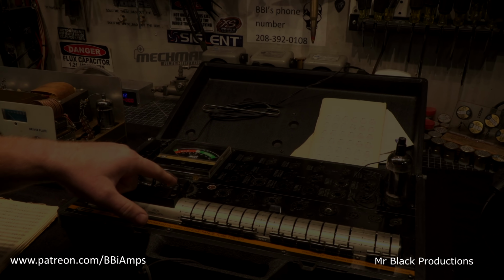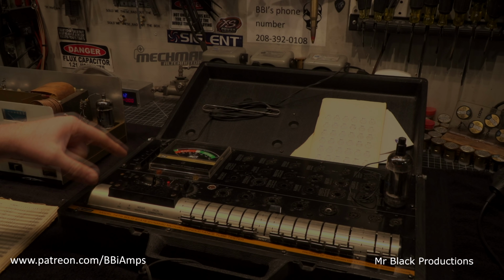It's a 6LF6. That means socket number 21. We reset all of these. We set the sensitivity to about 48, and we put the heater on 6. Let it sit for a second. 60% or so. They've got 110 written on the tube.